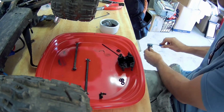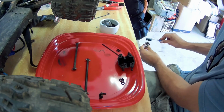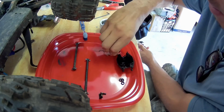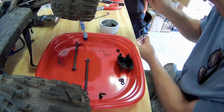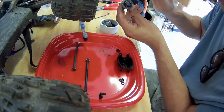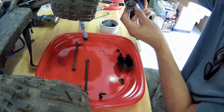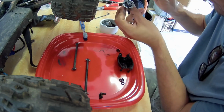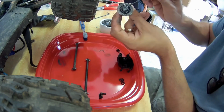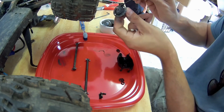There's just the teeth. There's wear on the teeth. And I imagine that's from when whatever this piece of metal was, spacer or ring or whatever that was, probably got chewed up and was in there floating around maybe, or when that tooth broke off. Maybe that's the tooth. I can't imagine that's the tooth, but it kind of caused some damage to the other teeth on this gear, on this beveled gear.